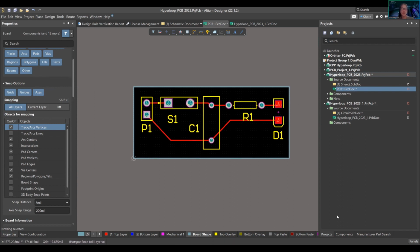And that essentially is PCB design. Unfortunately, we didn't get to talk about fab drawings or assembly drawings this time around, but next time we'll definitely touch base on that. Essentially, fab drawings show this board and the holes that exist on it. Fab house, can you make sure you can drill through this board and that this is the material for the board? And they say, okay, got it, let's do it.